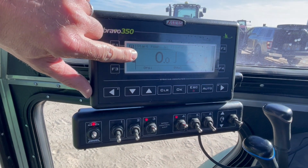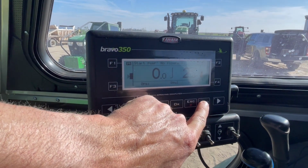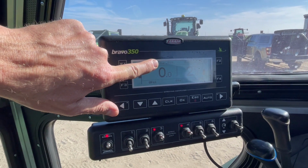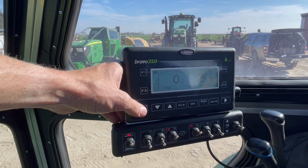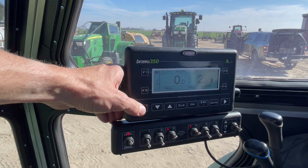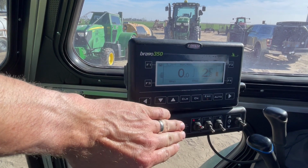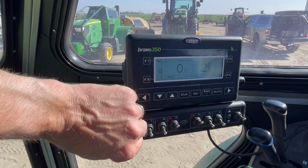This is the other new thing, start pump. So this feature here is to run for flow control. We're not using flow control, so when you push auto, it says manual regulation. That means that we're not using flow control. So right now the spray valve is on. So if you notice here now, I'm in manual mode. When you turn this switch on and off, it controls that valve. So if you turn it on here, you can actually control that valve here also. Or you can control it off the master switch.